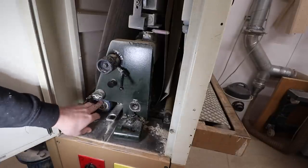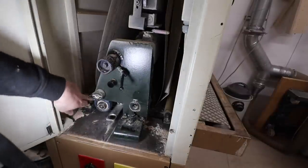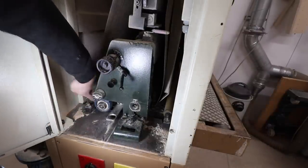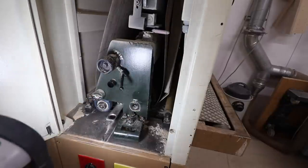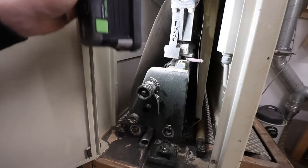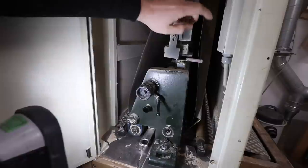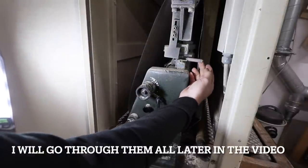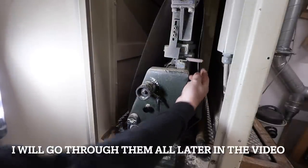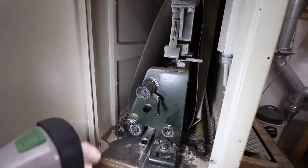The final roller is a back roller — it gets the belt flat so the pad can be applied. Behind that last roller there's another sprung roller that keeps everything held down to the bed, keeping everything nice and level as it runs through. While we're in here, there are all sorts of stops on the machine — loads of devices that need to be in the right position for the machine to actually start up. One is for belt tracking: if the belt tracks too far, a safety switch will stop it.